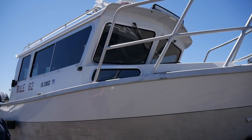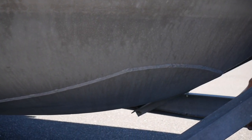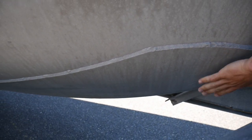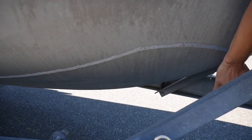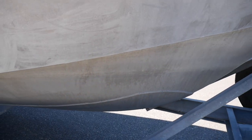One other thing I wanted to show you — this is special to this North River. They do not have these on the new ones, and that is an exterior quarter-inch keel plate that goes down the entire keel of the boat. It's welded on at this point, so you've got a quarter inch plus another quarter inch — solid right there. So if you strike a log or a telephone pole in the ocean going underway, that's going to keep this boat from opening up like you might get with another one.